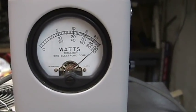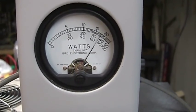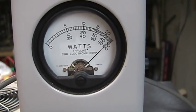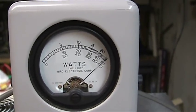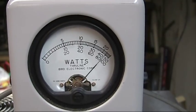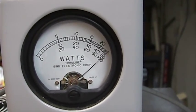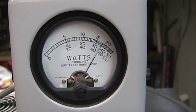Also, for you guys out there that have been using the static meters, my recommendation to you is don't — they seem not to work. A lot of guys are telling me they can't get over 4,000 watts on any kind of amplifier they use. For some reason there's something holding them back. I use the industry standard, which is Bird. If you're going to spend good money on an amplifier, then spend good money on a good meter. Get yourself a Bird 43 or Bird 43P.